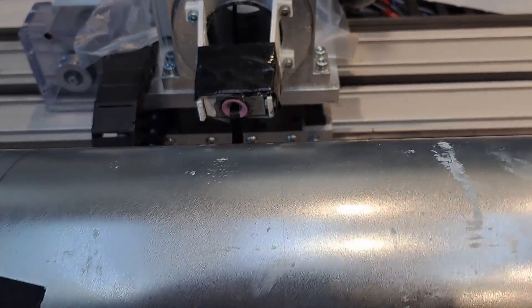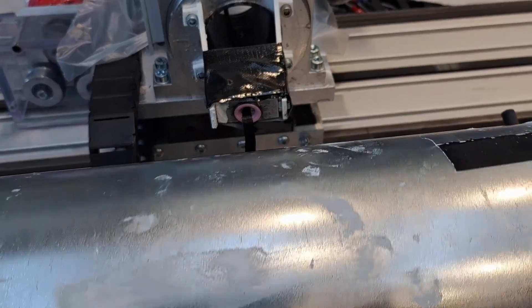Before the winding process, there's actually one little secret we're adding to each of these tanks: we want to have a good idea of what the temperature is inside the tank. This is important to figure out the level of nitrous oxide, because there's a barrier between the liquid and the gas — the liquid is quite cold while the compressed gas gets warm. You can tell where the liquid is just by knowing the temperature at each point of the tank.